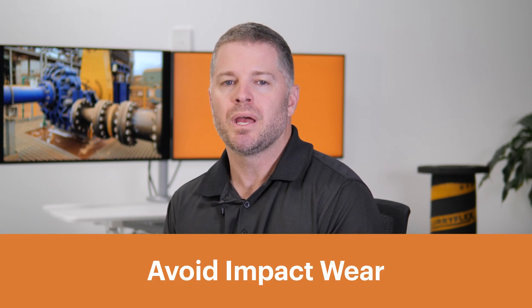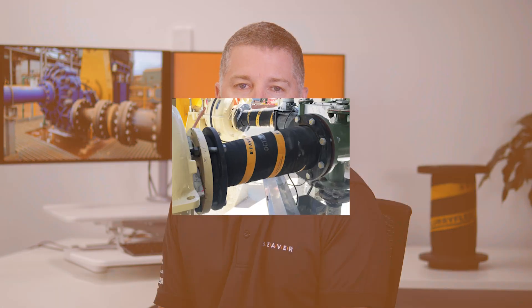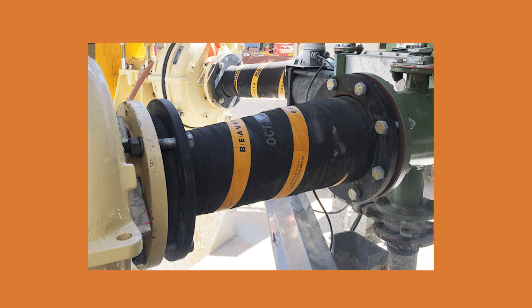To avoid impact wear, you need to reduce localised wear spots. One way is by redesigning your pipe bends as long sweeping curves. If you can't redesign your bends, avoid rigid piping — other sites are using mining hose instead, as it absorbs the impact of fast-moving slurry. For spools getting hammered by really tough slurry, upgrade from standard mining hose to ceramic-lined mining hose.